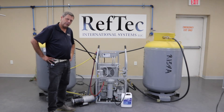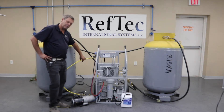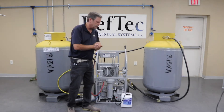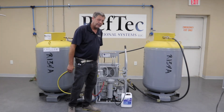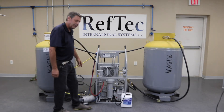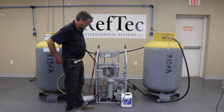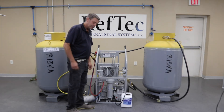To add the oil to the recovery unit, we'll start by adding it to the oil separator. On our center hose, we've disconnected the nitrogen or compressed air and hooked it up to our vacuum pump. We've got our drain hose back onto our oil separator, going into a graduated cylinder holding 16 ounces of new oil — POE or mineral oil depending on what type of oil is in the refrigerant we're going to be using for the next recovery. With our 16 ounces of oil going into the oil separator, we will turn on our vacuum pump and open up the discharge side. We will have our discharge valve — the king valve — open on the back of the compressor just a couple of turns. Once all 16 ounces are into the system, we'll turn our vacuum pump off.